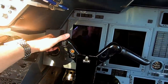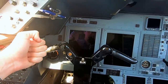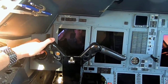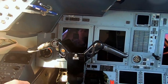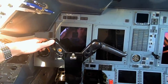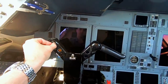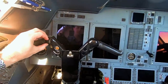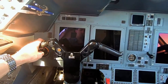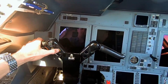It's a very comfortable yoke. Your hand sits kind of on top of it, whereas on the Gulfstream you hold it more traditionally — on the Hawker you hold it downward, and it's actually very comfortable to fly with. We've got our trim right here, just like on the Gulfstream, operated with your thumb. It is a two-piece trim switch, just like the Gulfstream, so you can work the two pieces individually as a fail-safe — in case one sticks, you're not going to get a runaway trim situation.